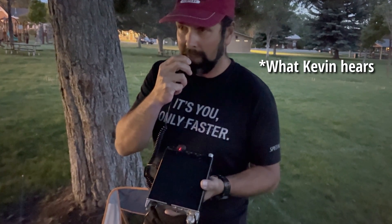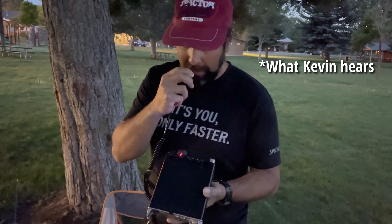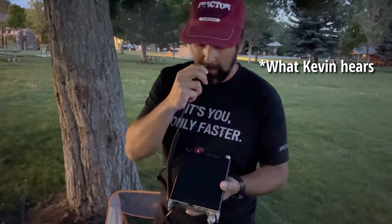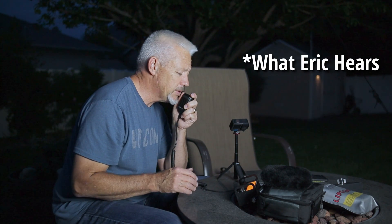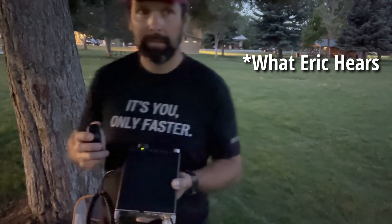What a great test for this first NVIS antenna test. Since you're not copying me fully I'm not going to go on and on, but I talked just long enough in case my signal goes up and down. Back to you, Eric. Hey Kevin, that came through much much better — I'm reading such low power and we're doing so well. That last one came in at about an S9, probably still somewhere between 3 and 4 for readability. Your signal is way up and then slowly back down — obviously it's QSB. Pretty impressive for 80 meters on a first try, I'd say that's a win.